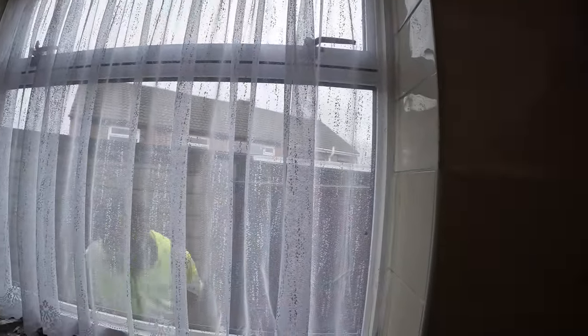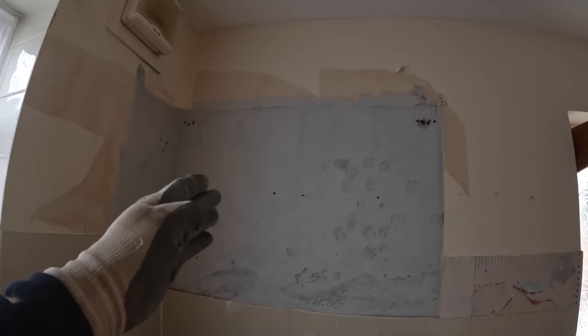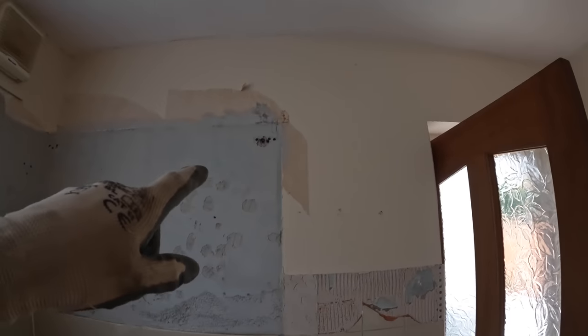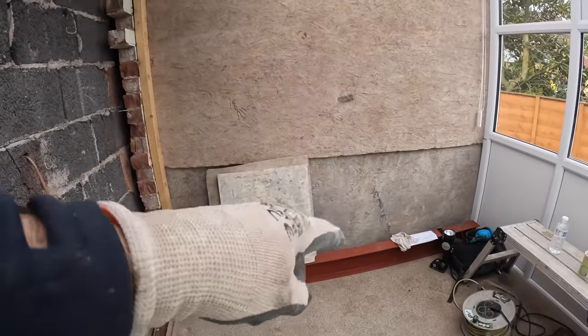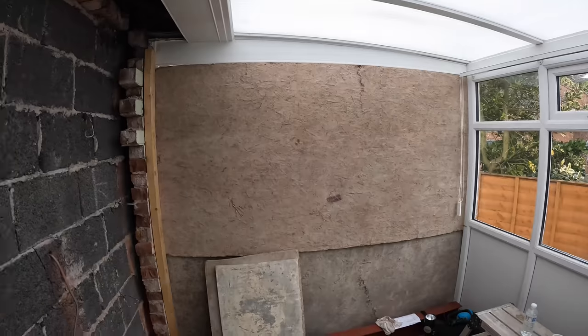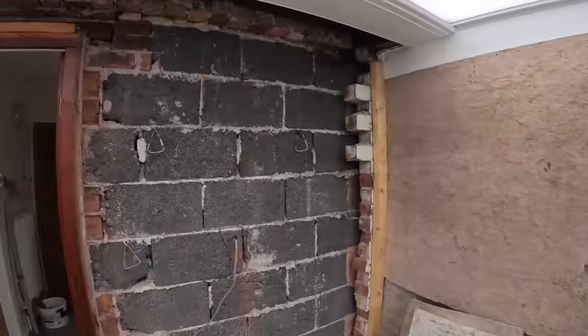Then obviously that's coming out. There's going to be a bit of a nib here. The rest of it's coming out. Steel going in to hold the roof up. That's going to be propped up and probably take that out today because we've secured that for now. Concrete's going in this morning, maybe this afternoon. So tomorrow, get that block wall up. And I think that's the last job, hopefully. Hopefully we get a lot done today. Got plenty to go at and nothing to hold us up, so we need to get moving today.